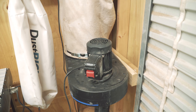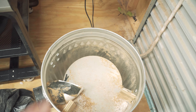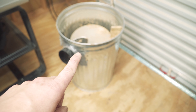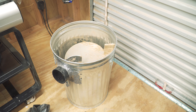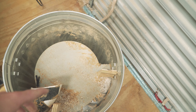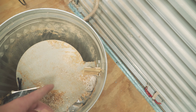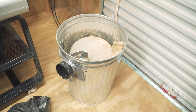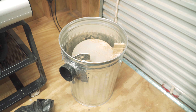I'm going to be upgrading this entire dust collection system one of these days to something a little stronger, and I don't like this design, so that'll all be gone. But this will get me by. Like I said, it's extremely cheap - these cans are $25 or $30 at most. I had some random plastic pieces laying around that cost me nothing, and that's an old scrap piece of MDF that I used the CNC to cut the baffle pattern out of, then screwed it to the walls. As the air is pulled in it circulates around and pulls most of the material down in there.